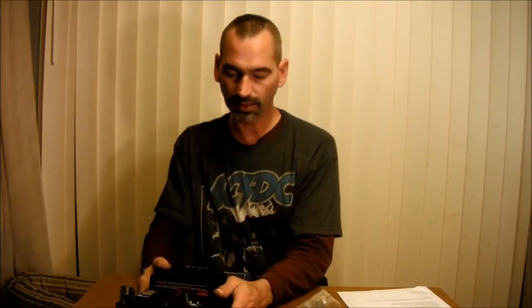For anybody that is into solar power, even just a little bit — whatever you do, spend the extra money and get an MPPT charge controller. You won't be sorry. If you get one that's not MPPT and then get one that is, you'll realize how sorry you were for buying that other one. I did that, and the non-MPPT one sucks — it'll charge the battery up but it doesn't take care of the batteries at all.